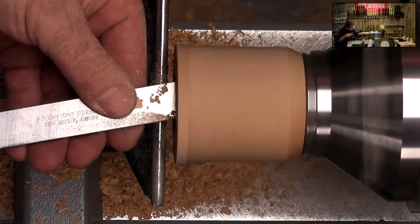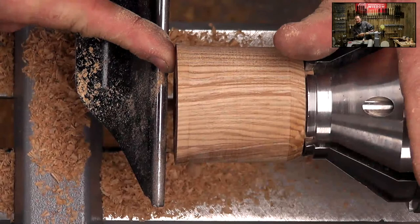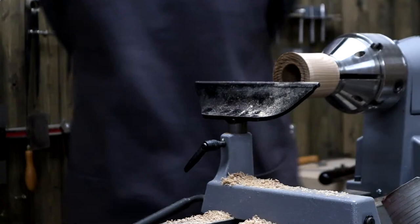What we're trying to do is get a nice equal curve flowing all the way from the centre with an undercut. The last bit I'm going to chase - the easy bit is towards the middle. Nice and light. At the moment we haven't cleaned up the opening down in here. I've still got a bit to come out - I need to square it up. I've got minimal flat edge, less than an eighth of an inch.